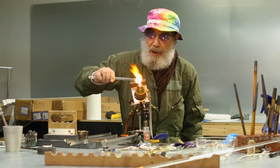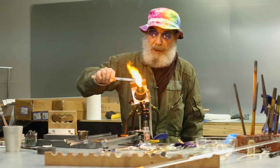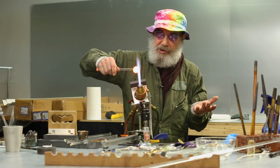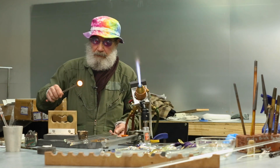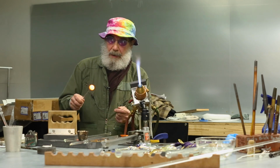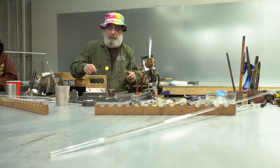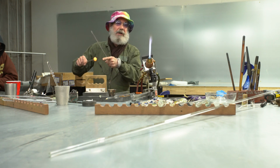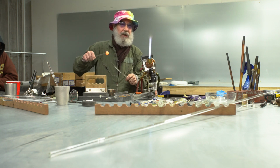So the thing about blowing a bubble through a piece of glass, one side might stretch, one side might be a little hotter. So I keep trying to put the hotter one to the bottom. So what's going on is if I just stand here and hold this and not keep it going round and round, air comes up and touches that and it gets heated and it wraps around it and starts a laminar flow, and it's pulling the air up below it. The air over here is not touching this glass. It's getting diverted by that laminar flow that's created down here at the bottom.